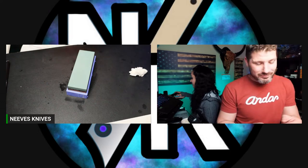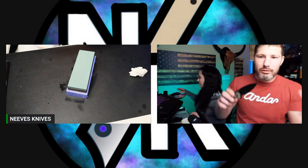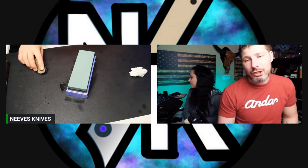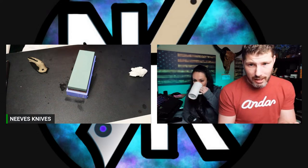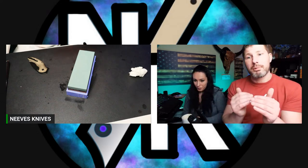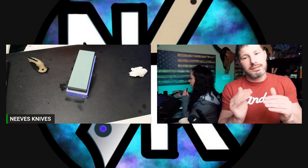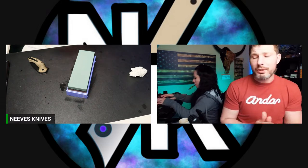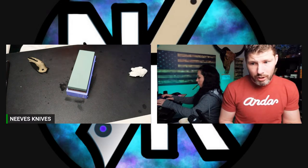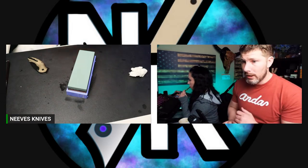All right. So as far as M390 goes, if you're rubbing your nail like this and you still feel microchips, that means you did not create a good burr on both sides. What happened was you probably got a burr on most of it, but there were spots on the apex that did not create a burr on both sides. Another reason might be the way you deburred. You might be being a little bit too aggressive with your burr removal.